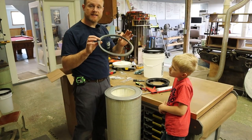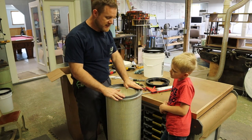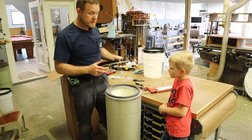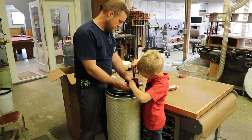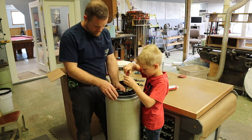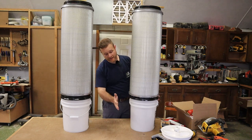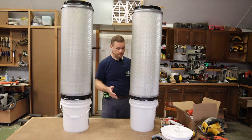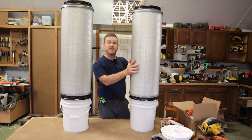The top side comes with a gasket attached. On the bottom side there's a loose gasket — you can either use the loose gasket to attach the lid, or just put a bead of silicone. I'm doing one each way to see which works best: gasket on one, bead of silicone on the other. You only have about a half inch of flat surface around the Gamma Seal lid, so make sure you get the gasket positioned just right. And there we have it — two completed filter assemblies. The bucket on the bottom catches any larger particles that get past your cyclone, and the Gamma Seal lid on top connects it to the filter box. Now we've just got to install it all.